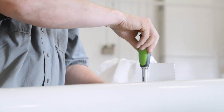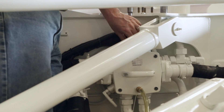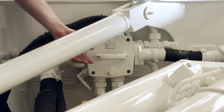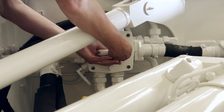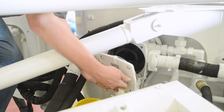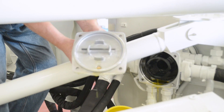I have to remove the vent plugs from both chambers — this is one filter, but it has two chambers in it. Now we remove the cover to give us access to the filter. You just pull towards you slightly and you will get a small splash, so put a pan underneath it.